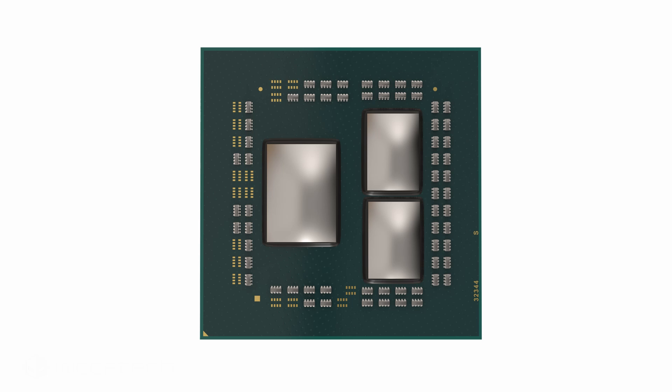On screen is the Zen 2 / Ryzen 3000 series — the total package with both chiplets in place, so this represents the Ryzen 9 series CPUs. You've got three chips here: one is a 12nm I/O die, and the other two are 7nm eight-core chiplet designs. The I/O die handles the memory controller, PCIe lanes, and all of that. The two eight-core chiplets are each comprised of two CCXs — two four-core CCXs — all connected via the Infinity Fabric.